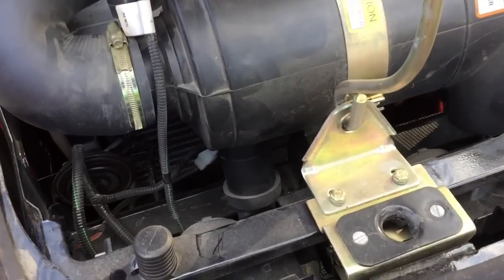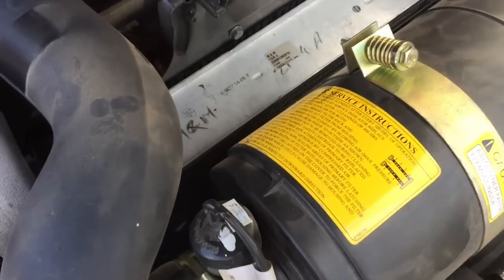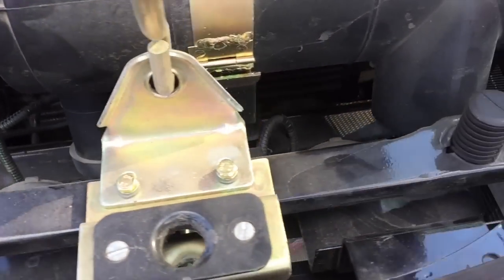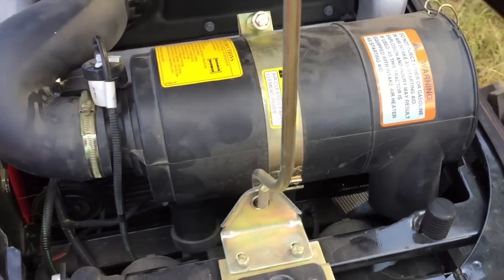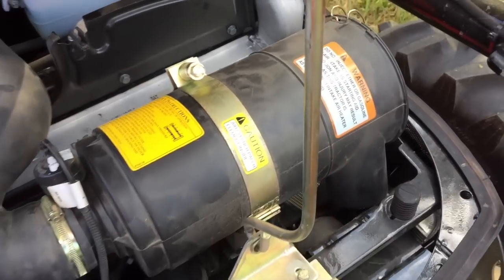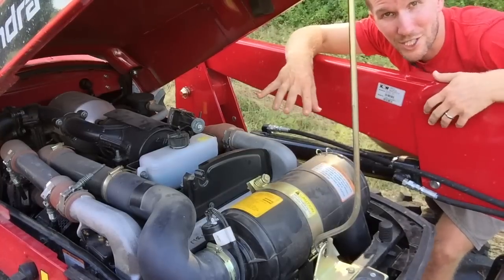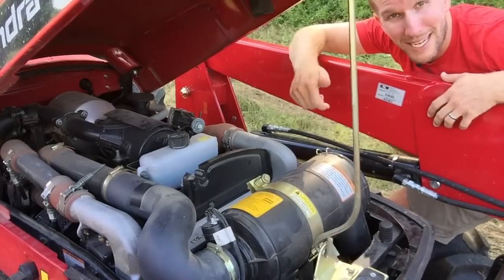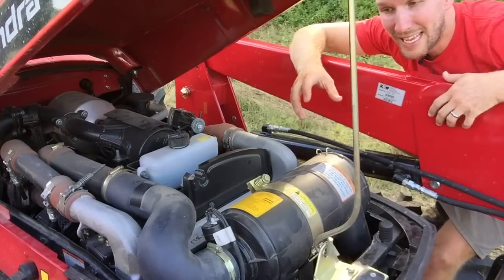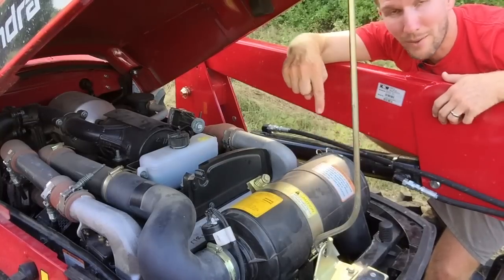And the front grill plate, so there's the radiator, then there's the plate, is bolted on with four quarter-inch bolts, so I have to take the rest of the front apart in order to get in there. Now, I've cleaned this once already, and I had to take the air filter assembly out and get in there. First, I scooped it out with my hand, and then I went in with an air compressor and blew the stuff out and made sure I got it out of the rest of the cavity of the engine, so that when I turned the machine back on, the fan didn't suck it just back up into the radiator, where it doesn't get enough air and overheats. And I don't understand why this front grill is so hard to take off. Why would you design it that way?